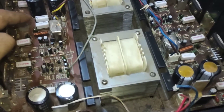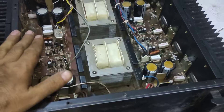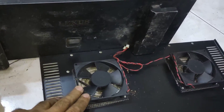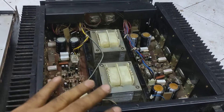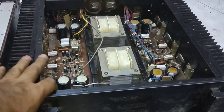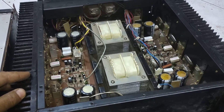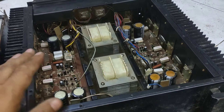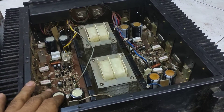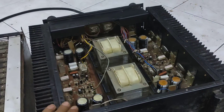The pre-stage uses transistors to drive the power board. For ventilation it uses two fans with air just blowing inside — there is no space for exhaust. The heat sink is very heavy metal and definitely takes a lot of time to cool, so the chances of inside components becoming too hot are not good.